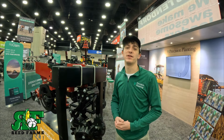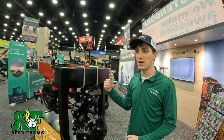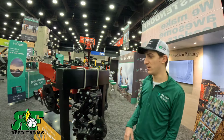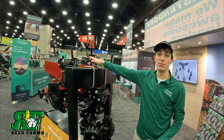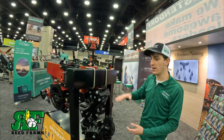And what happens if you've got a screw adjust row cleaner? You never adjust it. You go out there with the wrench, you crawl under there, you adjust one, you get back in the cab, you throw the wrenches, and you're done with it. And I'm guilty of it. Yep, absolutely. So what we've done is pull that row cleaner off of the row unit. Now we've improved row unit ride. We mounted it to the bar, so we got that chatter out of the row unit.